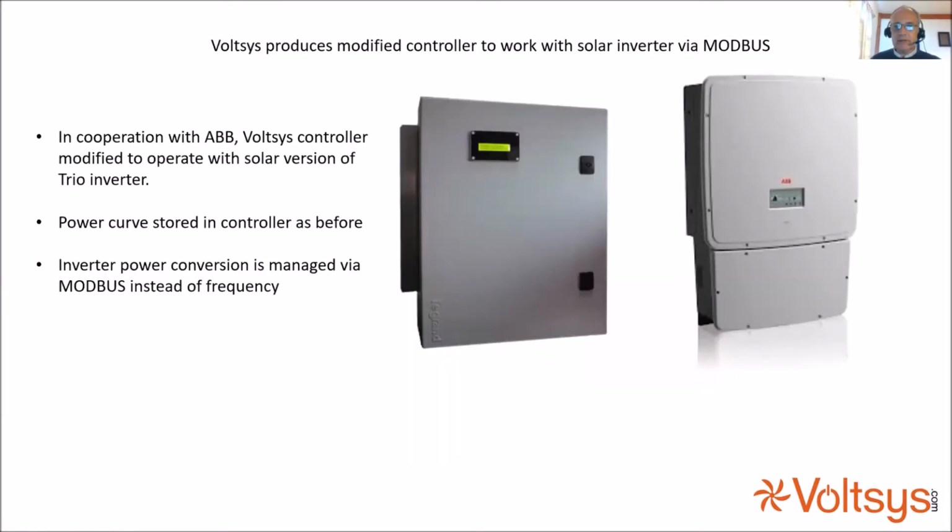We responded to this by changing how our inverter works so that it could work with the mass-produced solar inverters. This was quite a shrewder move than we thought it would be, because solar inverters are mass manufactured on such a scale that they're an awful lot cheaper than the wind models ever would have been. So we were able to work with solar inverters. We have a microprocessor in our controller which stores the power curve, and it tells the inverter how much power to convert based on either the voltage or the RPM of the turbine. This is managed by using the Modbus port on the inverter to disable the MPPT tracking and tell the inverter how much power to convert.